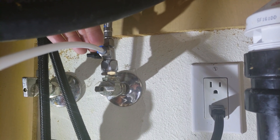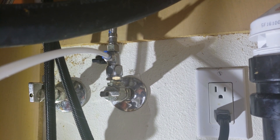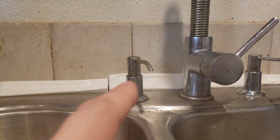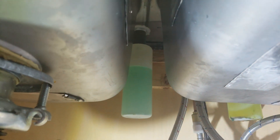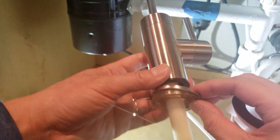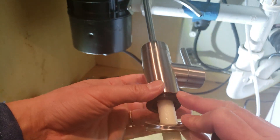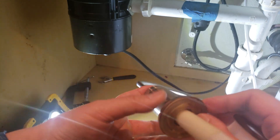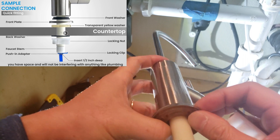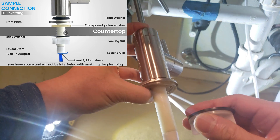Next I'm going to insert the white water inlet pipe into the T-valve, and don't forget to add a lock clip for each of the pipes. Now here comes the tricky part — I'm going to remove the soap dispenser. Fortunately I finally got it removed; it wasn't easy because it was caked up with soap. Here's the stack-up of the faucet assembly.